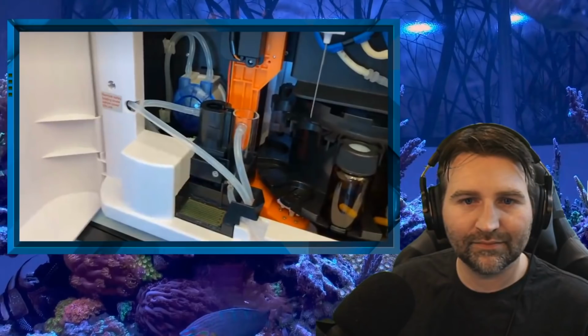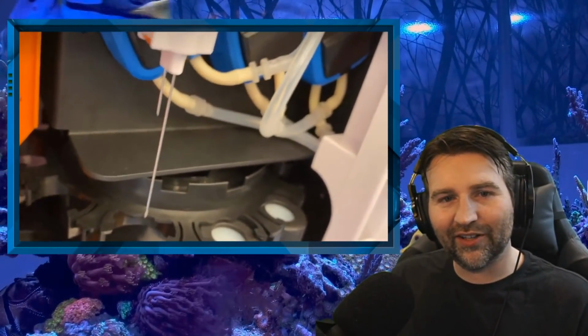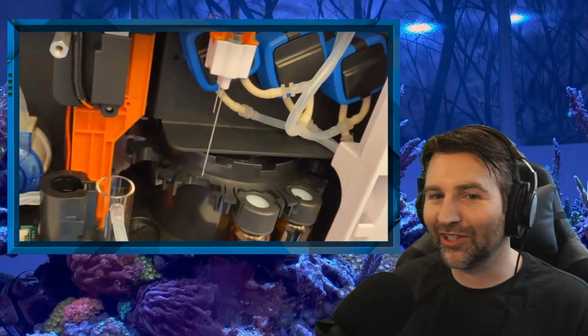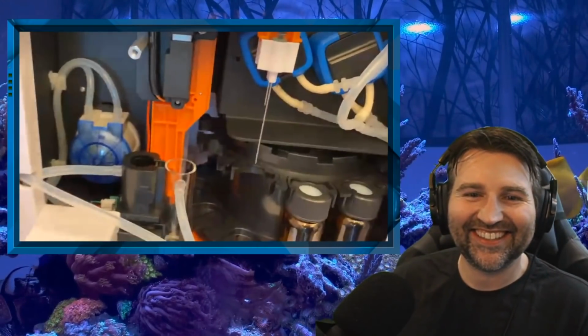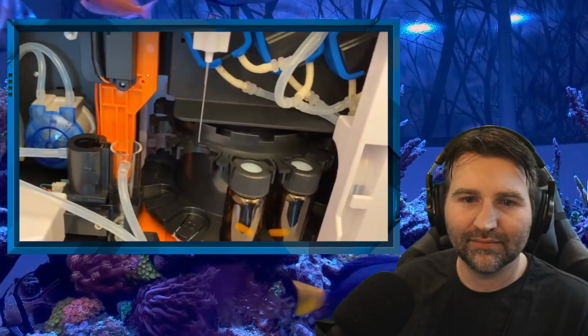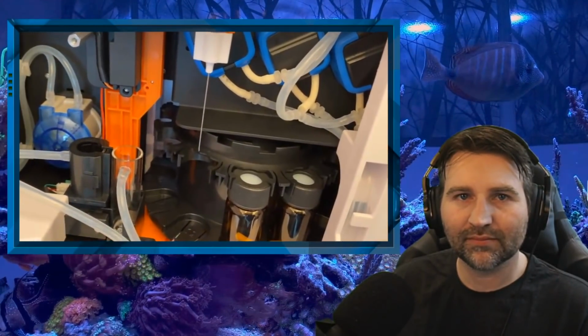And one of the things that, again, I give credit to Jonas for, is that we added two needles. Do tell. I was going to ask if you can guess why we have two needles. Not a clue, but I'm curious. These vials here are actually airtight, and the shorter needle is for venting.